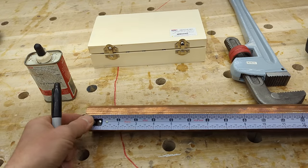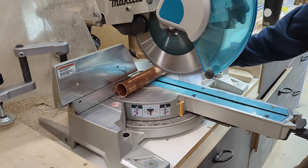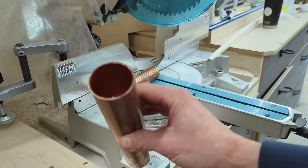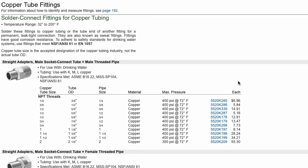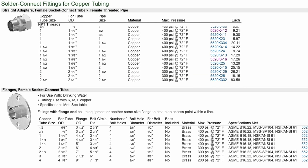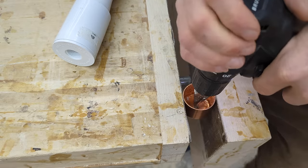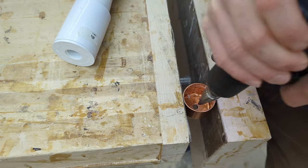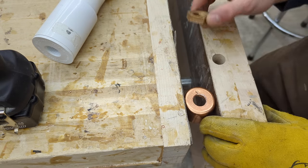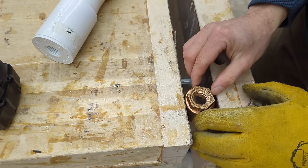Alright, let's make this little pipe thing. Step one: cut the copper pipe to length. I cut mine to 9 inches long — you can go a little shorter, but not shorter than the length of the heating element, and you could go a little longer. I used a miter saw; do whatever makes you feel safe. Step two: making the end caps. This step kind of sucks — I couldn't find copper adapters in the right gender, size reduction, and everything to make this work, so we're going to solder or braze the brass nuts and copper end caps together. I'll do the smaller half-inch pipe thread nut first. First, drill a centered hole in the end of one of the copper end caps just slightly smaller than the inner diameter of the threaded nut — size it so after soldering you can run a tap through both layers so the threads continue through both.